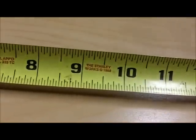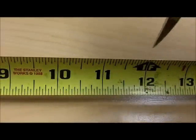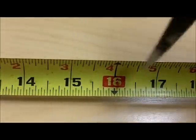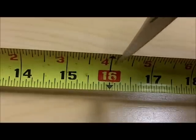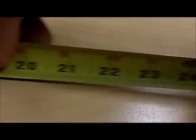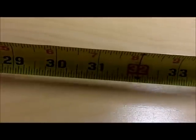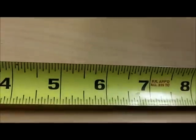As you can see, the ruler is marked in inches and fractions of an inch. It's also marked in feet — twelve inches equals one foot. If you're a person engaged in framing a house, the wall studs are separated by a distance of sixteen inches — they're put up on sixteen-inch centers. So these tape measures are often marked at sixteen-inch increments. There's the second one at thirty-two inches, marked in red so it's easily visible.